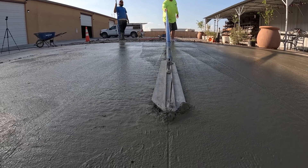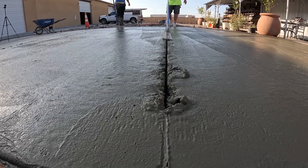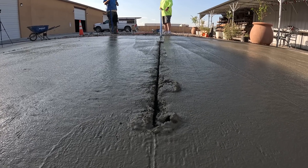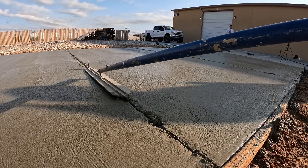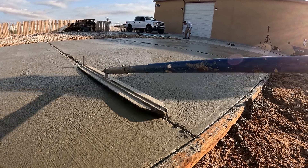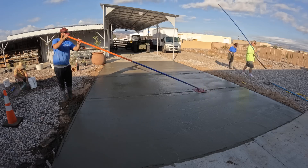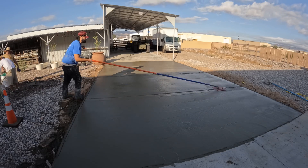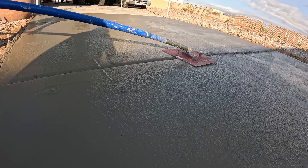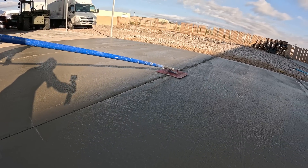This tool right here is three feet long, two and a half inches deep. Because it's three feet long, it tracks really straight once you get it started. What it also does is break the aggregate down deep, so it guarantees a crack in that location. Then here's your final joiner going over it — this gets your nice clean radiuses. This one goes one inch deep with a three-quarter-inch radius on both sides.